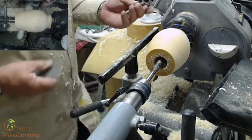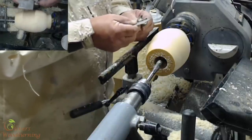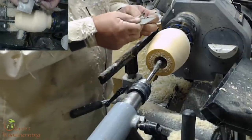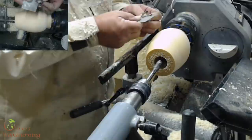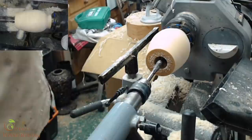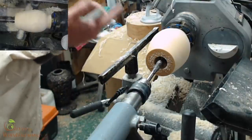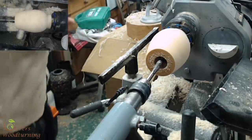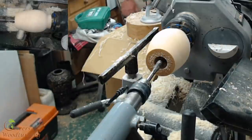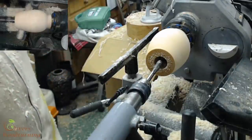I'm fortunate that I've got a set of Colts, and they sharpen much better, in exactly the same way though. This angular face here, just like that, and like that. And that keeps them sharp. So if you keep them sharp, you can cut at 500 RPM, and your smoking and burning is because your Forstner's got blunt. There endeth your sharpening lesson for the day. So, glasses back on.